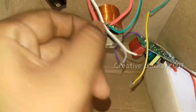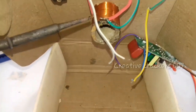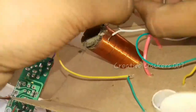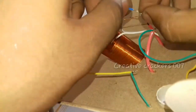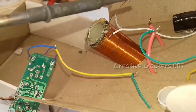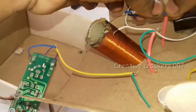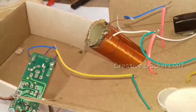It is pretty easy. Now just connect the secondary coil enamel wire with the primary wire. Both should be connected to the ground, which is the negative of the high voltage. For easy purpose I am connecting a wire to join both the secondary coil and the primary coil's negative end.